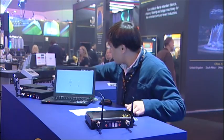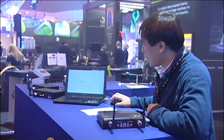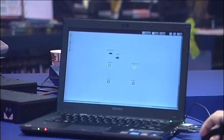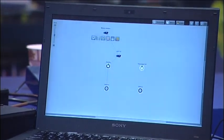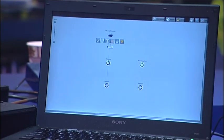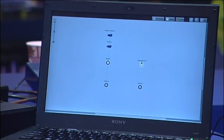My Blue Box system is connected through our WDMX transmitter and receiver and to a set of test fixtures in the box. When I press discover, over RDM we discover and pull back the topology of the entire system — that's the transmitter, the receiver, and any connected fixtures downstream. You can see them here clearly. So it allows you to see all RDM-connected fixtures through that one system, and allows you to configure the Ethernet-to-DMX network.